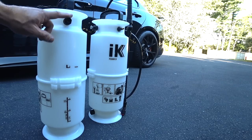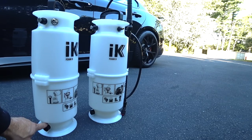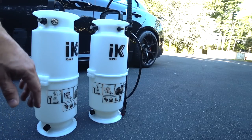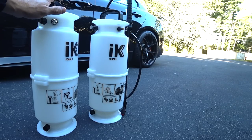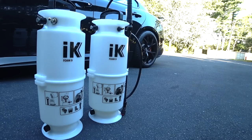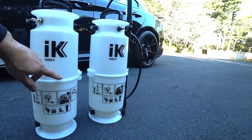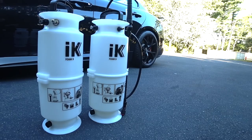An incredible number of customers have stripped or cross-threaded that cap, causing leaks. The IK9 also has a drain plug with a rubber grommet — many guys unscrewed it, lost the grommet, and had the unit leak everywhere. A lot of customers report getting black plastic inside the reservoir from pumping too fast. The footprint is also an issue: it's taller, skinnier, and easy to topple over. Customers have rolled them downstairs, cracking and leaking at the seam.